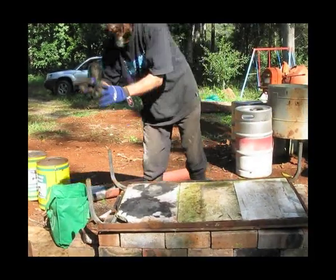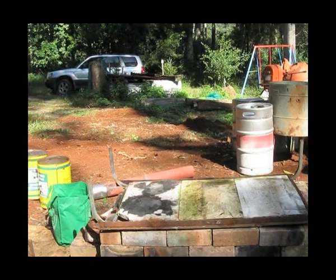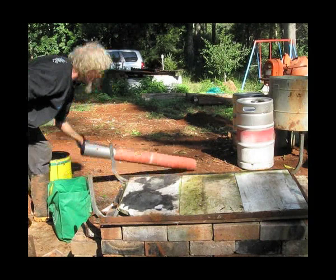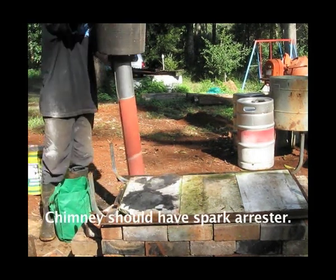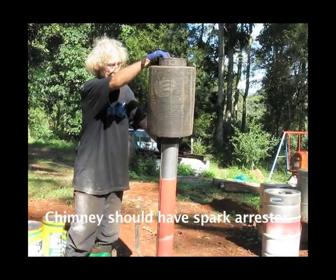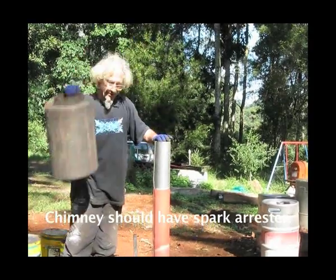The hot draft goes up the chimney. You're looking at the chimney output to make sure it's clear — it comes out shimmering. And in Australia, especially in the outback, we have to have a spark arrestor to stop large amounts of material escaping during the startup routine.